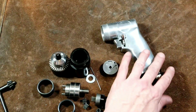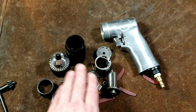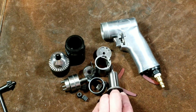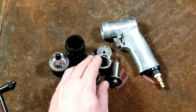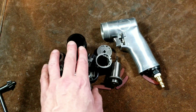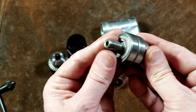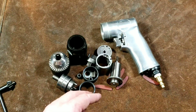Generally I wouldn't recommend this. I just wanted to show inside so you can see that it's a standard design — air drills are all pretty much this style — but the nicer ones actually use a single-piece ring gear that's keyed in, so they fit securely and hold securely. That's really the big reason not to get these Harbor Freights: they won't hold up long term. Even in the short term you'll think, 'God, this is a weak air drill' — and it is weak, especially once these gearboxes start slipping. Once it starts slipping, you really have to wrench down on this to get it tight enough to prevent slipping. When it's a half-inch drill going through steel, this really isn't meant for it, especially with a lot of sideways load on just a tiny little 3/8 spindle. Just not worthy. Thank you so much for watching — please subscribe. Caddis Maximus out.